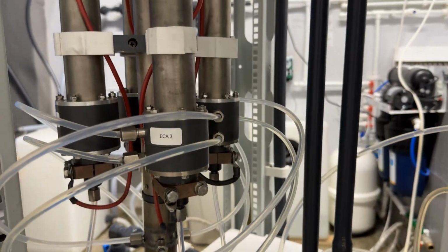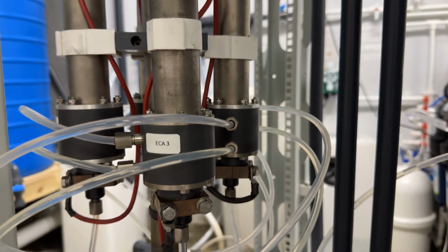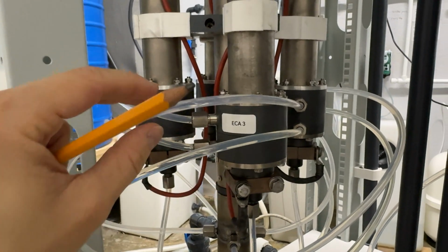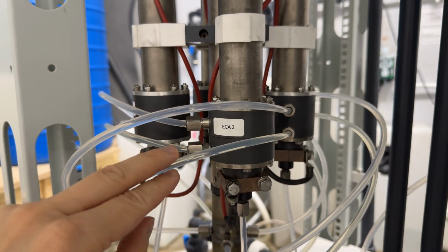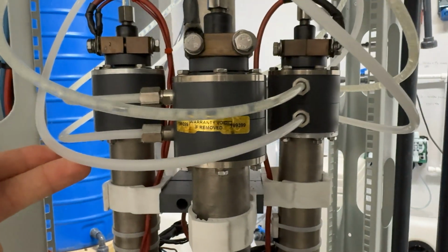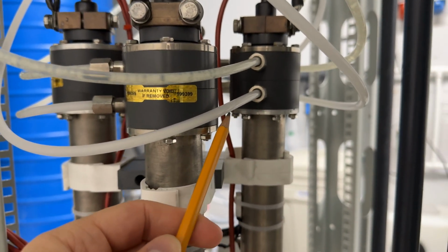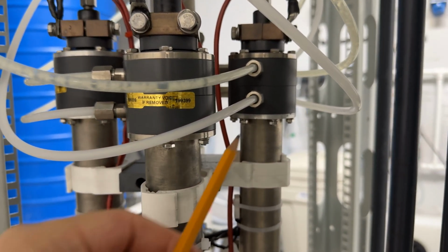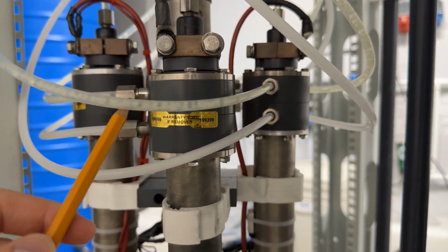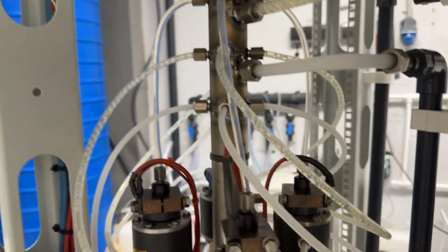The interesting thing is that the inlet tubes, this is the inlet to the cathode chamber, this is the inlet to the anode chamber, they are just with liquid. Here caustic soda circulates, here brine solution circulates. But the outlet tubes, you can see they're full with gases. Here it is caustic with hydrogen, which is then separated, and here it is brine solution, which is not converted and will go back with gaseous oxidants.